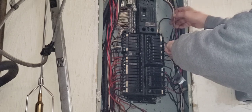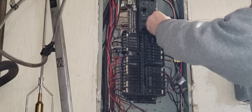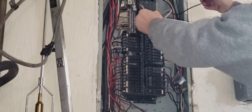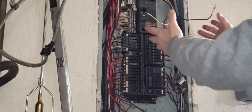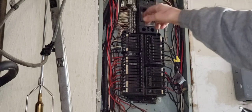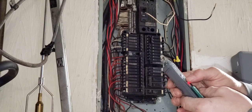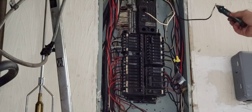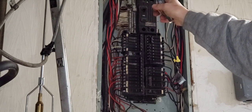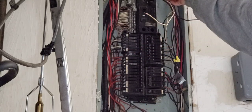I have it up and out. I'm going to keep my hand on this one and pull the black one out. There it is — black and white. I'm going to pull them apart and keep them out. These are dead, but for the sake of the video I'm going to use the tester. Oh, the battery's low. I put it by the wire — it says it's hot. It might just be picking up the nearby box since everything in here will show hot.